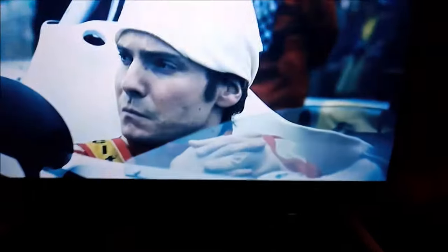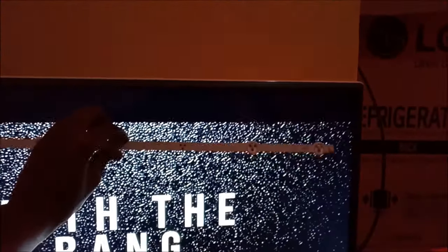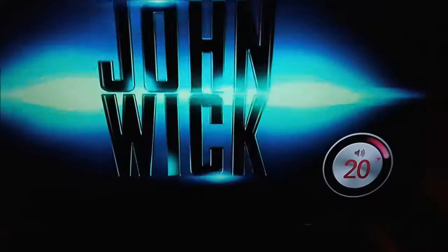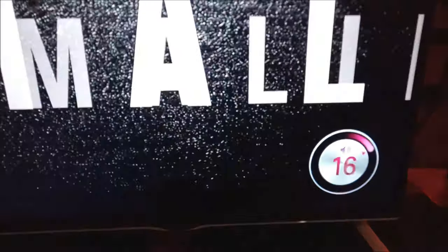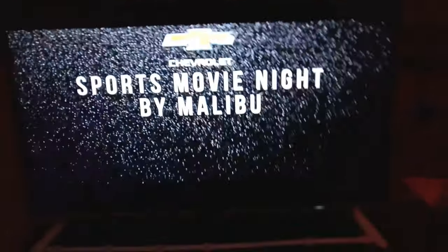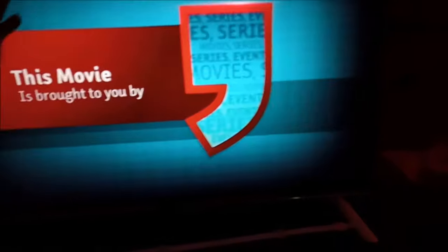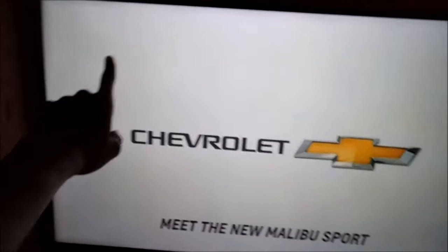On your TV, we have three such lights. One over here, another one over here, and a third one over here. If any of the lights do not work, your TV won't work. The only thing you'll hear is sound. Sound will be okay, but the pictures will be somehow faded. So they connected them in series too, because if one light does not work, it's better to have the whole TV not work instead of having a dark spot over here or maybe over here. So let's go back to the lamp and finish our setup.